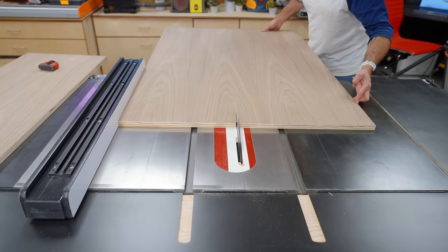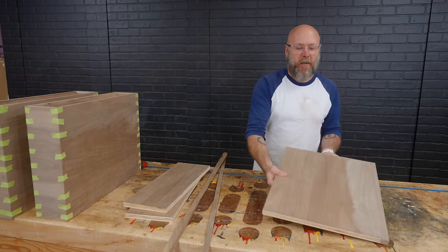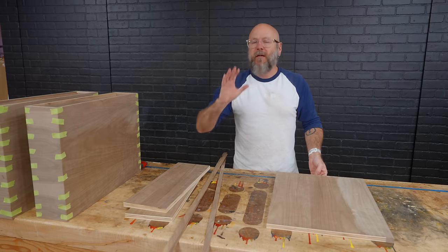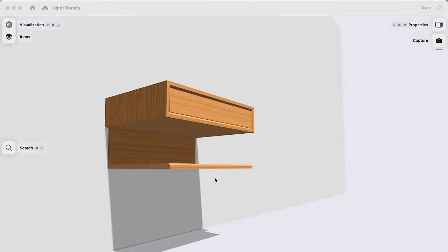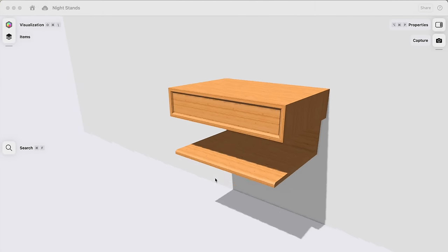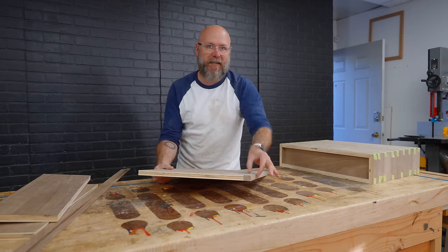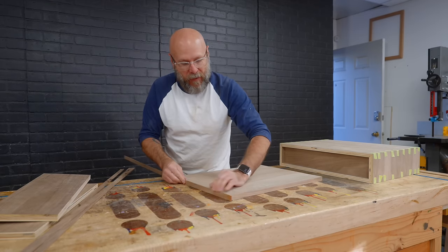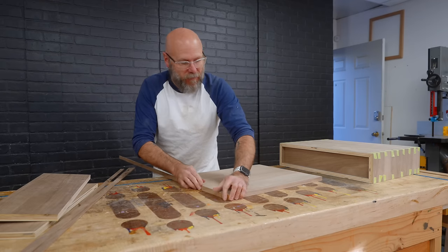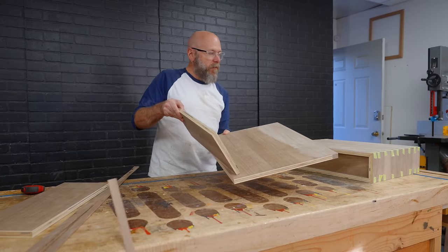We got to get back to the bottom shelf on this nightstand — we've got some figuring out to do. We're going to do something a little experimental here — I'm not sure if it's going to work, but I want to have a shelf that comes out like an L from the bottom of the cabinet. Big solid edge wood banding on the front; on the sides I tried to go as thin as possible. We're going to tape and glue the L together and then problem-solve.